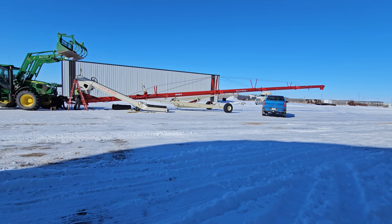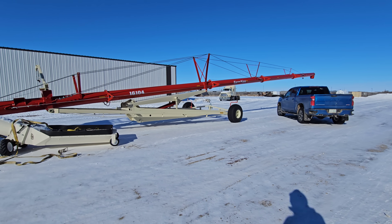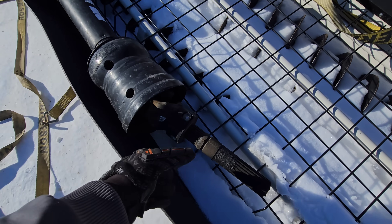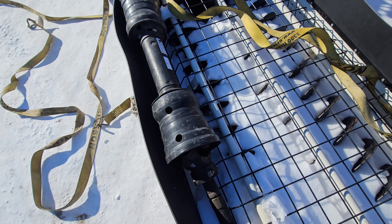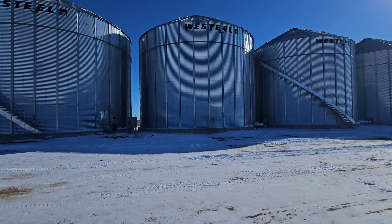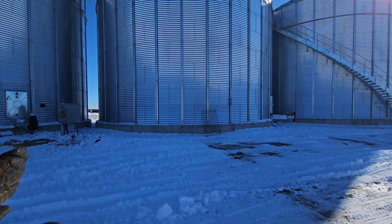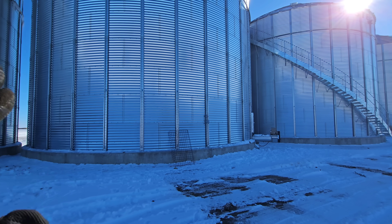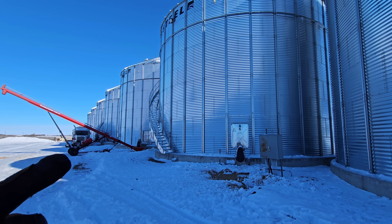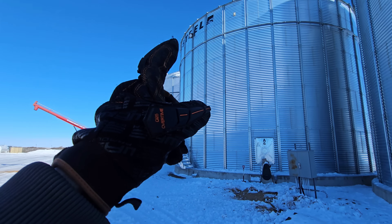You can easily reach a nine-ring bin with a 104. You can actually do it with an 85-foot — a 16-85 — but it is pretty hard on your PTO drive shaft because you're at such an angle. We pretty much go through one per season when we only have an 85-foot auger going into that bin. Now these are 48-09s, so 48-foot diameter. The bins up north are 42-12s — twelve rings high — so you have to have that 124 to reach them. The eave and the diameter make a big difference.